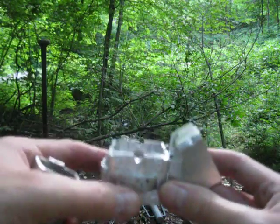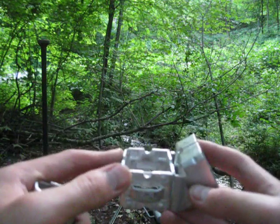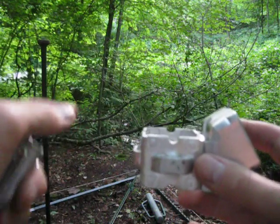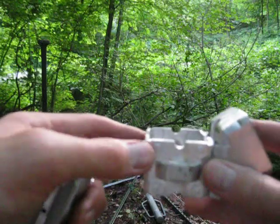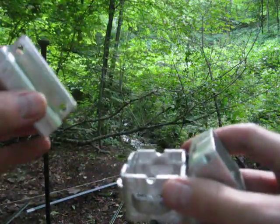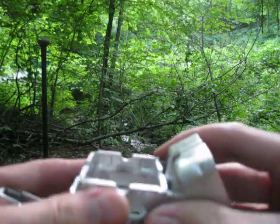It's tricky, especially if you're doing a corner where it goes both ways. The orientation — I know in the instruction manual they tell you to miss the lugs that stick out on the T-post, those little bumps that stick out on one side. But I've found you're able to get it in even if you do land on top of one of those lugs, depending on how bad you want it to sit at that location.